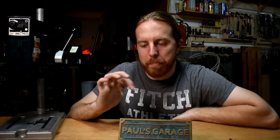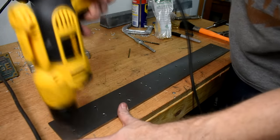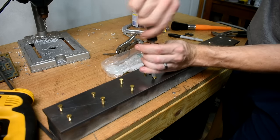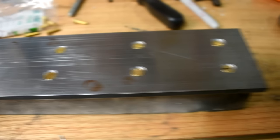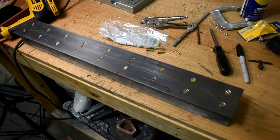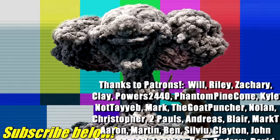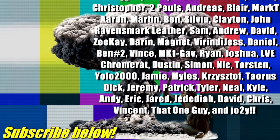But not so easy because all this drilling and tapping led to burrs on the top of the bed and the bottom of the ways where they come together. I just took the countersink bit, put it in the drill, and kind of lightly touched the surfaces of all the holes - that seemed to work. If it's stupid and it works, it's not very stupid, is it? Clean up all the metal shavings everywhere, put it back, screw it all down nice and pretty, and finally it's done. It only took five years and like five trips to the hardware store to drill a few holes in this thing. I feel oddly both accomplished and terrible at this at the same time. Next time we'll be doing the castings for the feet, and it's going to be a bit crazy. My throat cords made it to the end of that - throat colds suck. I ate like an entire value-sized bag of cough drops before doing this and it didn't help. Not even a little bit.